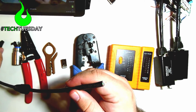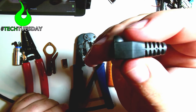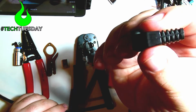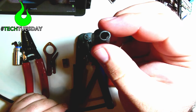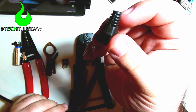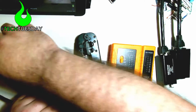All right, we'll come back to this guy in a bit. If you're using just the regular RJ45 strain relief, you can do that. Now, the one in the description, which is this guy here, works best on Cat5, so it has a pretty small opening on there. So you can use your cutting tool just to remove some of this funnel on here, and it'll be a little bit easier to get onto a Cat6 cable.